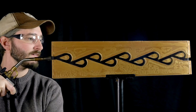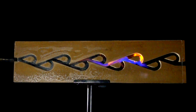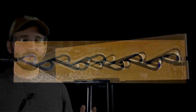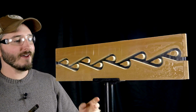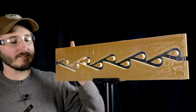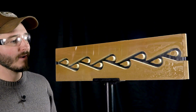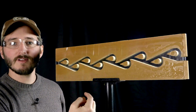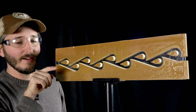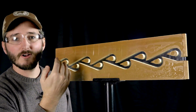Interesting. All right, interesting. Sometimes the flame doesn't make it all the way through to the end. So this is actually pretty interesting. On the high speed, I was noticing as we're forcing the gas through the direction that it does not want to go in this valve, the tails of the fire coming back through these little channels are actually accelerating. It appears to be faster this direction than this direction, even though this is the direction of travel that the flame front is moving in.